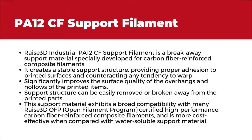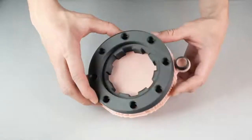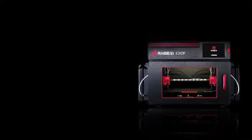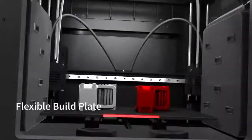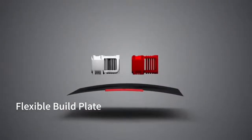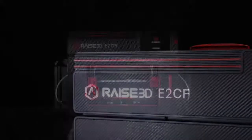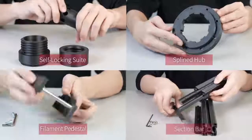With the new carbon fiber support material, it is also perfect for quickly removing supports off of parts, and it leaves a beautiful internal surface finish on those areas as well. Overall, the E2CF has been redesigned and evolved from the already existing E2 system. It uses very similar printheads and the same flex plate system, so you'll already be familiar with the setup.